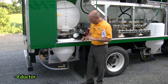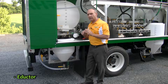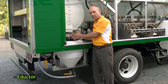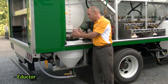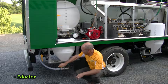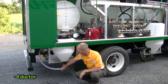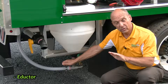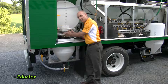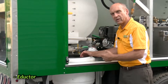Nothing's going to happen until we open this valve on the bottom. So I can put my product in here. A warning about heavy granular products like Davey Arbor Green: you cannot put an entire bag in at one time — you're liable to get it to bridge. We recommend putting a small amount in, maybe a quarter of a bag. Then you can open this valve, and once you open it, it starts to educt whatever's in this tank out into your target tank. If you close it, it stops. You can also open this valve in advance before you start pouring your Davey Arbor Green or other granular product, so as you pour it in it'll be sucked out simultaneously.